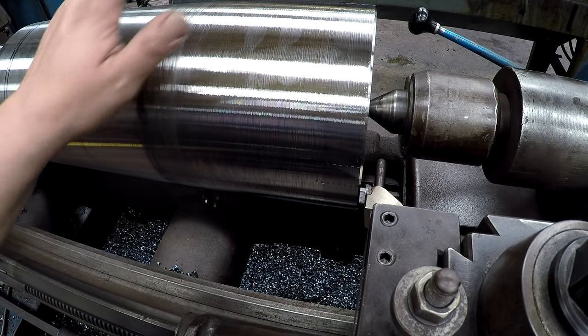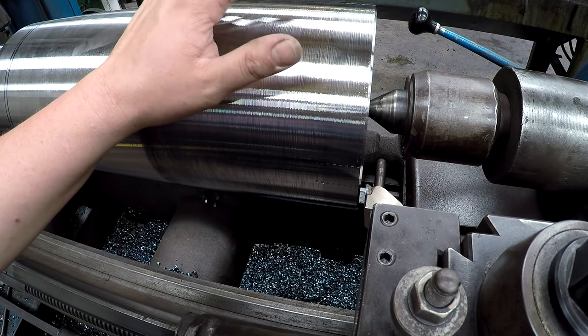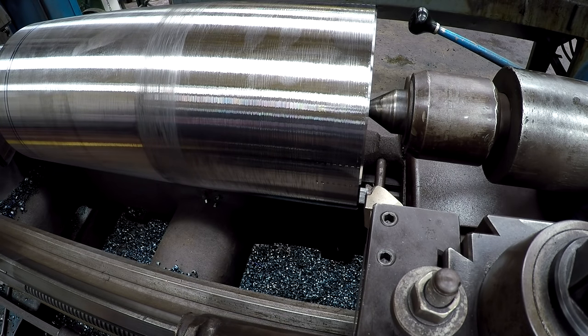We got the shaft flipped around. I'm going to go ahead and rough this side. We've got a pretty good ways to go down. It's about 8 inches right now. We're going to take it down to 7 inches. I'm going to do another half inch pass, quarter inch per side, same feed rate, everything, 20 thousandths feed, same RPMs. Just got a little longer cut to make.